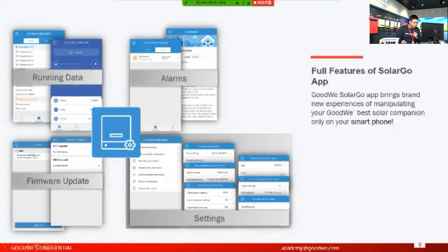Basically, you can go to the parameters page. There will be a long tab. Click on the tab and you can find the current fault that occurred to the inverter. You can see this is a VAC failure. You can see when this failure happened and the error code. When you click this failure or error, on the next page, you can check the details of this fault.